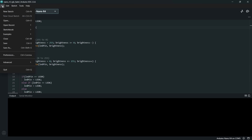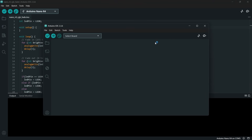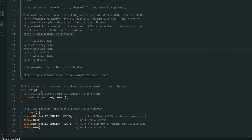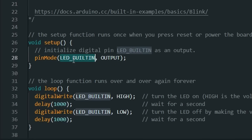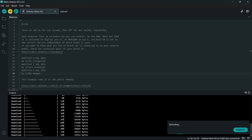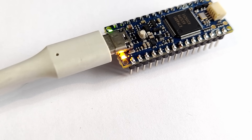To run the blink program, go to Examples, then Basics, then Blink, and that will bring up a new sketch. It's a really simple program. Because this is microcontroller programming, you have a setup function that gets run once — in this case it sets the built-in LED to be an output, which of course is the orange one. Then the loop gets run continuously: we're setting it high, waiting a second, setting it low, waiting a second, as simple as that. Make sure you've got the Arduino selected and the board plugged in, then hit the upload arrow, which will compile the code and upload it to the board. Once that's been uploaded, we can see the LED flashing.